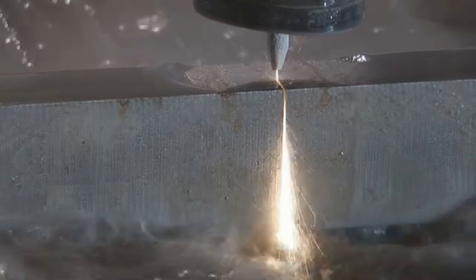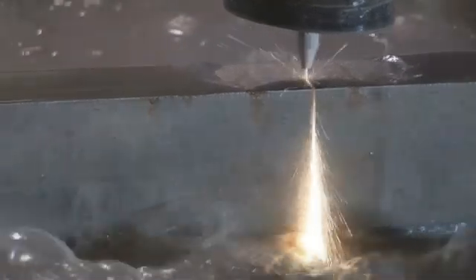We have seen here at Nottingham for the first time that with water jet machining you can even cut diamond, which is quite surprising when you consider that industry spends hours and hours cutting with electro discharge machining when the material is conducting. But there are particular composites of diamond which are not conductive, so we replace much slower technologies like laser machining.